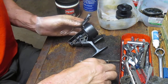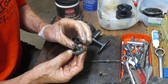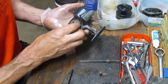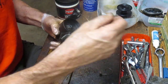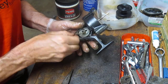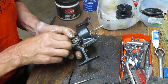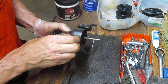Okay, I had to put that bushing back, so it's good because it's a review here of how you do that metal wire. You line the wire up again with that guide hole, kind of eyeball it in. And again, if you have a good lighting source, you can see whether you're connected or not. And that's connected. Back in with the shaft. Now I've been skirting these little retaining washers here, which keep that on, but these do come off if needed. It provides the balance as this cycles. Just a little shim washer. But they're important.